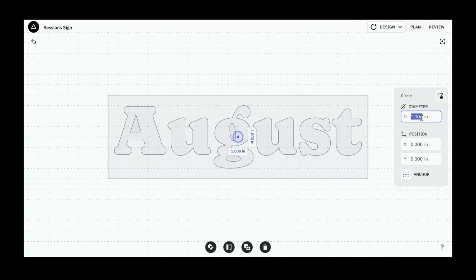I'm using a 0.375 inch dowel. You could make this a 0.375 inch hole. It's likely that you're going to need to use an offset to tune that fit. In the design for this show, I know these are snug, so I actually made them a 0.377 inch hole. And you still needed to use an offset on this, didn't you, Jake? Just 1/1000 of an inch? Just so we could get it apart if we needed to, but yeah, it would have fit. Really what I would do is I'll make this 0.379. There you go. And then when I do this later, I'm not going to need any offset at all.